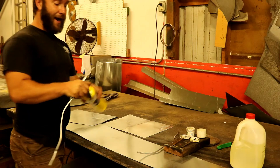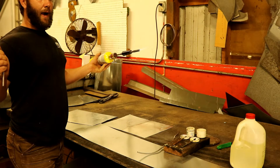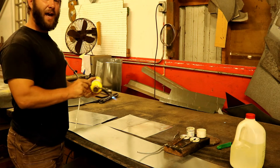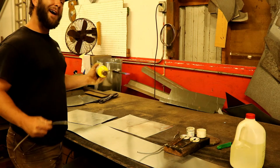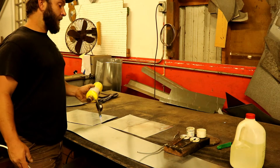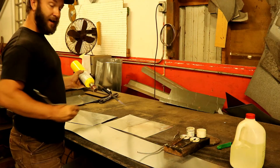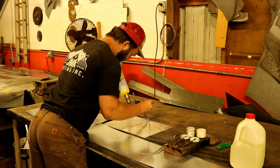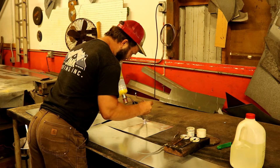I hold the flux in my right hand and the torch in my left. Because I do this so frequently, I don't look at the flame — it's all by ear. I know by the sound of the flame where I'm at and what my temperature is. When you solder outdoors on high areas like roofs, you can't see the flame at all — it's only sound. So with the torch in my left hand and solder in my right, I lay a bead, working both in unison, riding the fine apex of heat — not too hot, not too cold.